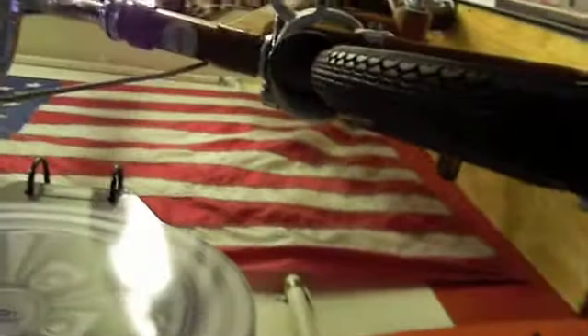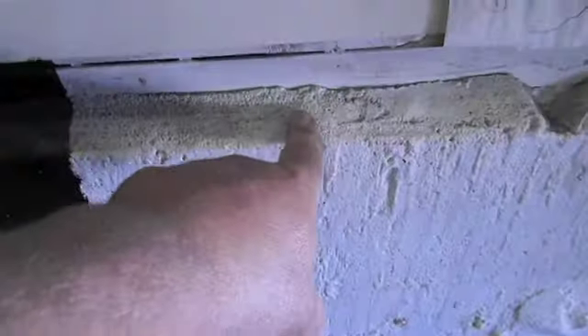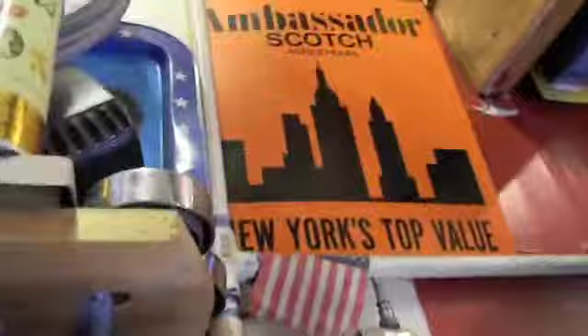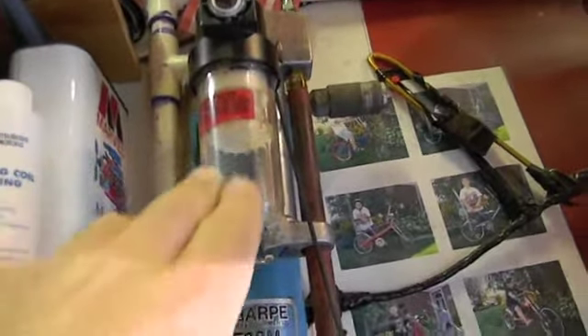I've got a big drop-off on this one — that's gotta be three feet. I'm coming down from a 12-foot ceiling on my loop. The foundation is four feet off the ground, so maybe six feet total. When I replumb everything, there'll definitely be a water separator. This was my first one — a little one — and I didn't rely on it to do much. But it was amazing; I barely ever got any water in it. I never spit water even when I ran a DA forever using this setup.